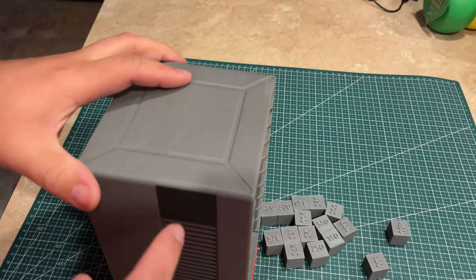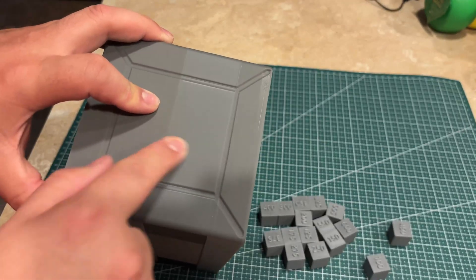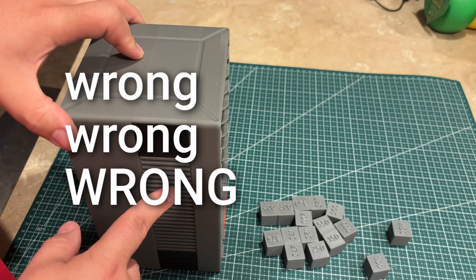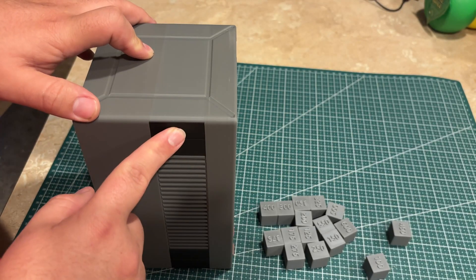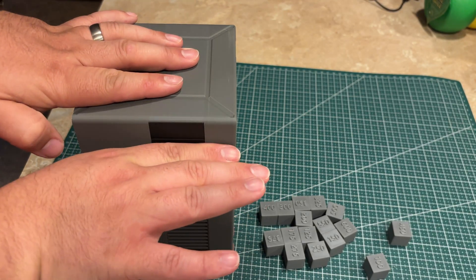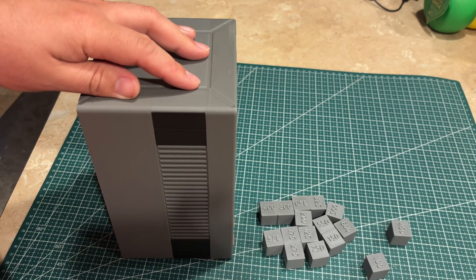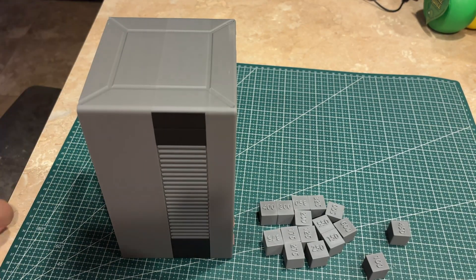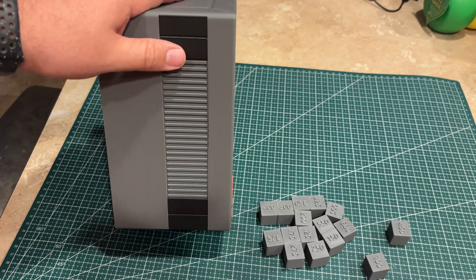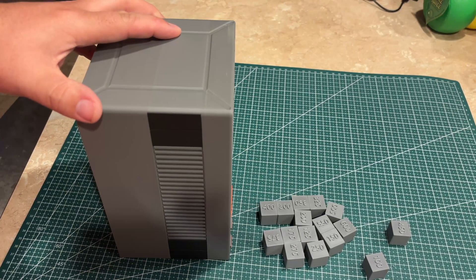Unless the heat is fluctuating — but then why would heat fluctuate for that section? If it did like a black purge in there, this would be darker, not lighter. What I'm going to do is take this model, slice it, and just print a portion of it but change the color I use so we can do a much quicker test — maybe just a half inch of it. I don't have a lot of this gray left since multi-color creates an insane amount of waste, so we'll try a slice and investigate from there.